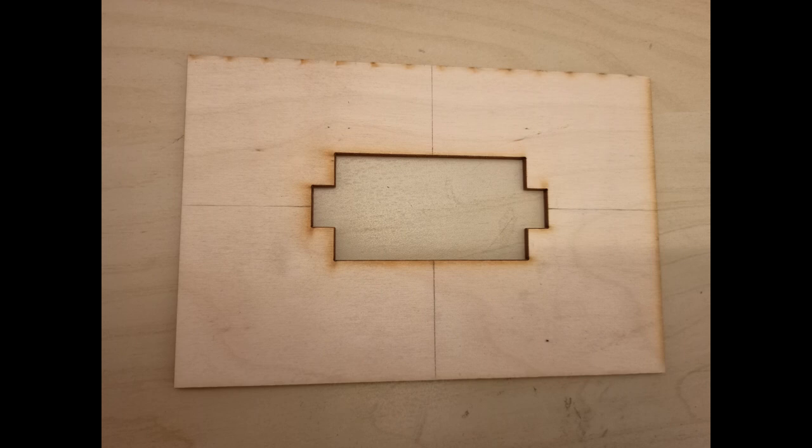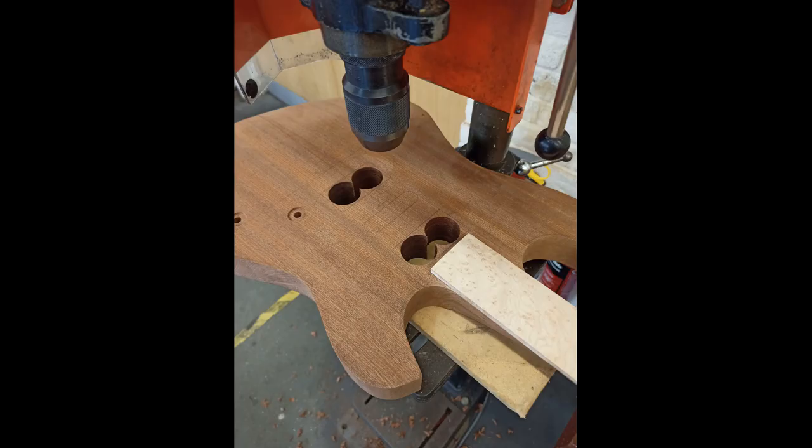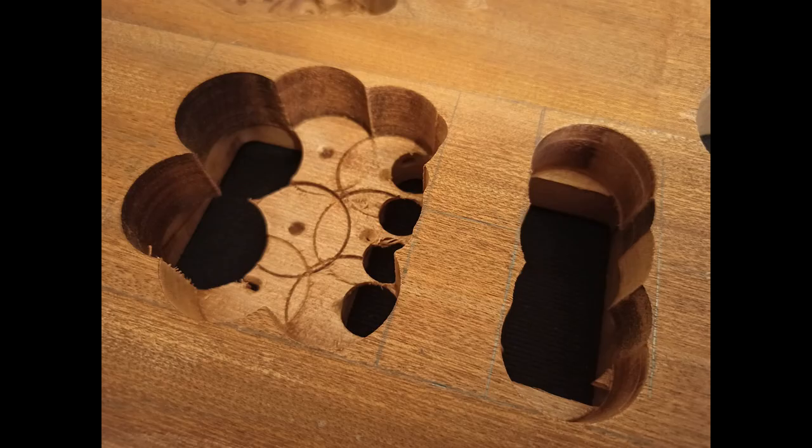This was a template my father-in-law Bill kindly made using a laser cutter — as you can see, it's a lot more accurate. It has little ears on the pickups to allow the pickup mounting pieces to go into the guitar, but what we actually went for was a back-mounted pickup so that you didn't have to see those ears from the front. The pickup pokes through from the back, and here we are pillar drilling right through the guitar so that the pickups can be mounted from the back — a little unconventional, but we went for it.